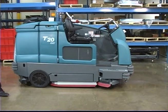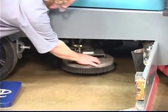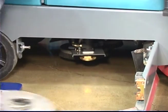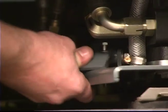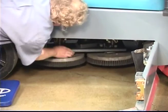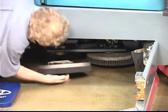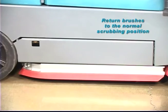If your machine is equipped with a disc brush scrub head, you can access the brushes by opening the driver side squeegee door. Next, squeeze the spring handles and let the brush fall to the floor. Place the new disc brush underneath the hub assembly, then lift the brush up onto the hub until it's locked in place. When the tab on the rear of the scrub head is pressed down, the right side of the scrub head can be pivoted to access the center brush. Repeat this process on the other side of the machine to change the left scrub brush.